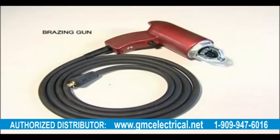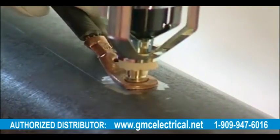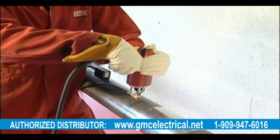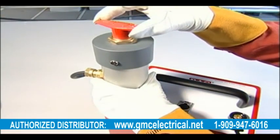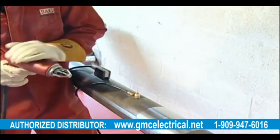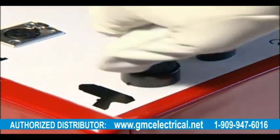Brazing gun. All standard brazing guns operate in basically the same way — they consist of a solenoid and a trigger mechanism. When the gun is set and ready for use, activation of the trigger will energise an electromagnet within the gun body and lift the brazing pin away from the substrate to a set distance. This will be enough to create an arc and initiate the pin brazing process. With the exception of the easy bond reach system, which has a separate trigger requiring a manual reset, once brazing is complete the standard gun will automatically reset as it's removed. The gun comes with a 2.7 metre cable and must be securely attached to the battery box using its plug's push and twist feature.